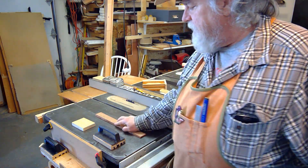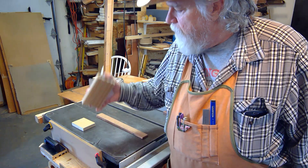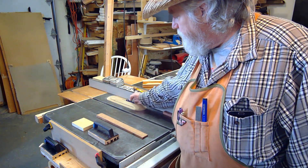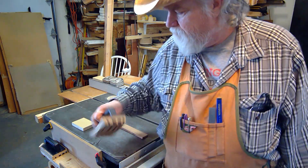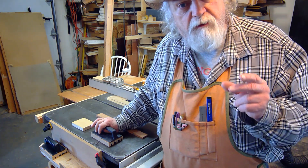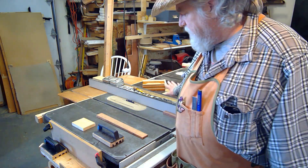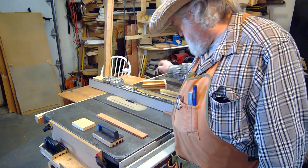I decided: the NMP gripper is great for pieces over an inch and a half wide, no matter how far from the blade, if you're less than three inches from the blade. But if you're cutting a board less than an inch and a half wide, the NMP gripper doesn't work well — that's when I'd go to the heel push stick. Finally I decided that rather than tearing something up all the time, I made what I call the flipper gripper.